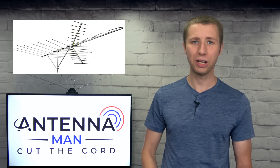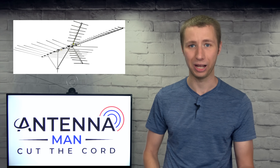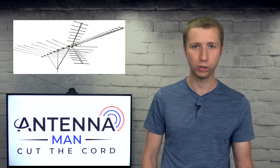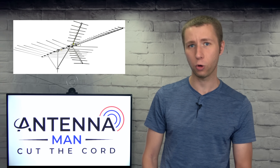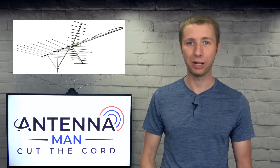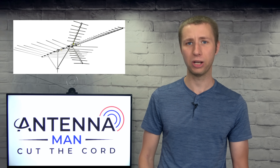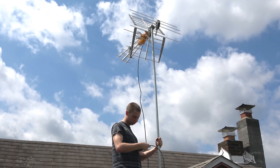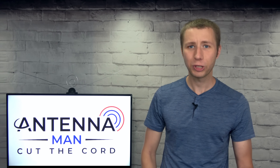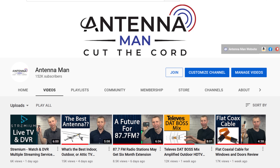You never want to just put an antenna up in a random spot, point it even if you're using a compass, and hope for the best, as you won't see what channels you're picking up. At some locations, moving the antenna as little as a foot or two can have a huge impact on reception, especially if there are a lot of trees around. Some type of signal meter is critical to find the best spot. I can't tell you how many times I went to install an antenna, planned to mount it at the peak of the roof, then checked the reception with my signal meter and noticed one station wasn't coming in well. Using the signal meter as a guide, I moved the antenna around until I got reliable reception of the problematic channel.